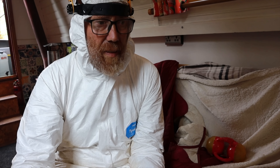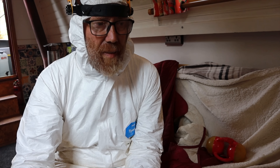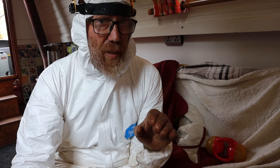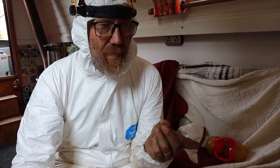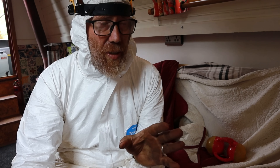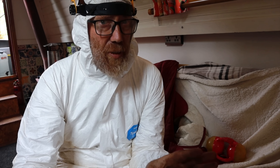We're going to come back in a year, come out again. We've got to make sure we rest on a different point, because the bit that we can't get to now will need looking at. And then in a year's time, we make the decision on what we're going to do — is the corrosion stopped, is the two-pack paint that we're putting on halted the corrosion, and we're safe, good to go. Perhaps for the lifetime of the boat.